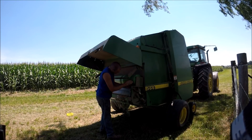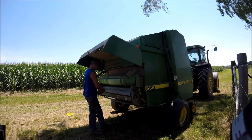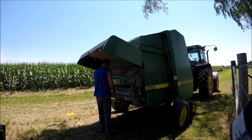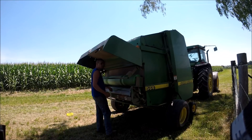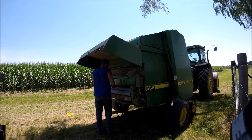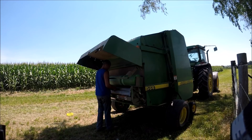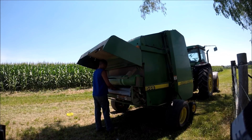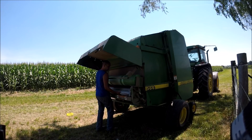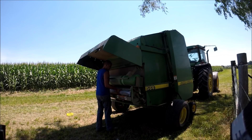I'm rolling the net wrap back to save as much as I can. I'm going to cut out the excess length but make it as short as possible. I grab it and wrap it to put it all in a tight bundle towards the end, then take my knife and cut it all off. Now all the wrap will be approximately the same length, and I put it down between the rolls and get it started. You don't want too long of a tail because it will bunch up behind the knife.